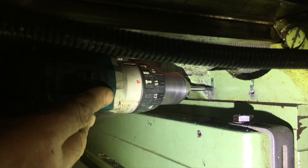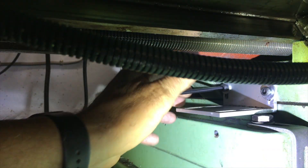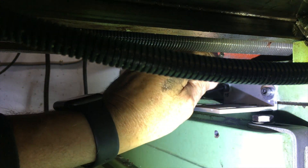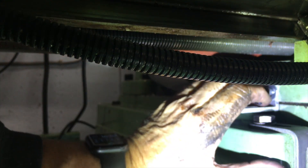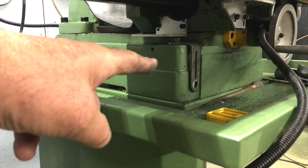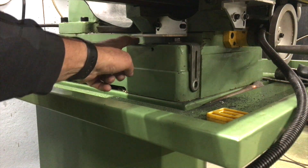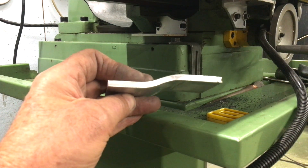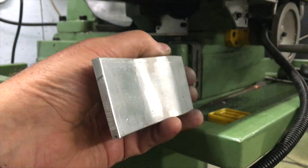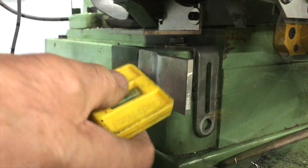For this scale I had to use two brackets to support the sensor. Like the front scale I pre-shaped the first bracket and marked the main body with a marker pen to position the two drilled and tapped holes. To mount the scale I had to overcome a couple of obstacles: one was that the scale mounting face was about three degrees out of vertical, and two I have some suds drain holes in the main casting that might just aim the coolant into the sensor. To deal with the vertical mounting face first, I had some six millimetre thick bracketry that with a bit of pushing and shoving I could, with the help of a very big set of Stilsons and a stout vice, bend the said piece of six millimetre aluminium plate into shape, which I managed to do.